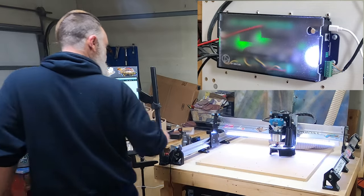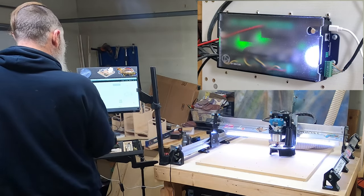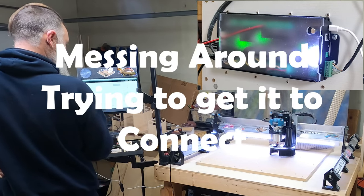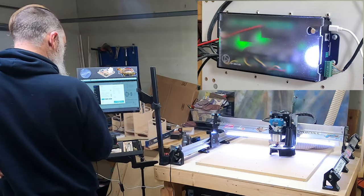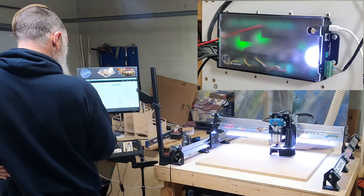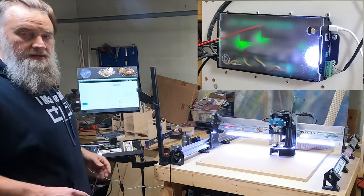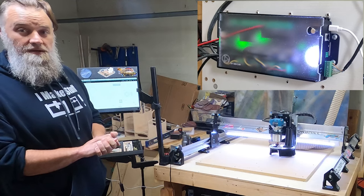All right. All those are on. Okay. Let's, oh. Okay. So, I do not think this is going to work with this version of G-Sender. Because it's Grbl HAL, we are going to have some issues here. So, it's not gonna work. We need a new sender.